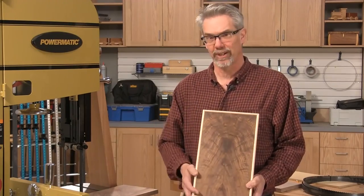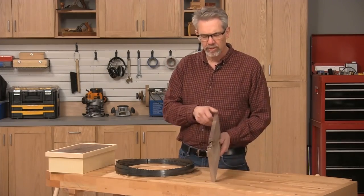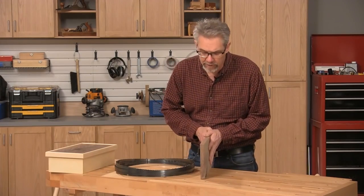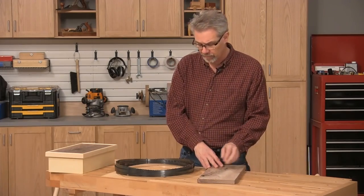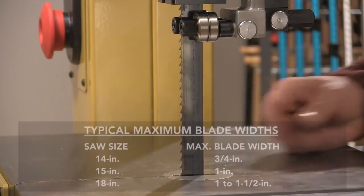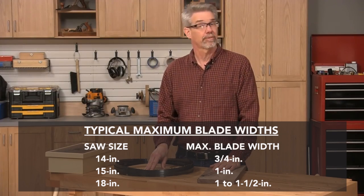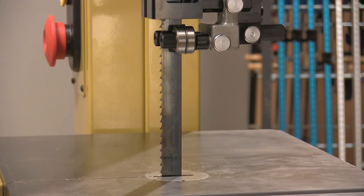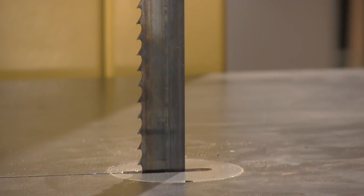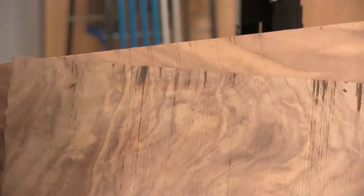How do you re-saw? Re-sawing is pretty easy on a bandsaw, but there are a few rules that will make your life even easier. Your stock should be prepared with two parallel faces and an edge that's 90 degrees to both of them, so you can balance on that edge as you feed it into the bandsaw. With re-sawing, wider is always better for your bandsaw blade. With our 15-inch bandsaw we use a 1-inch wide blade, but most 14-inch bandsaws allow up to a 3/4-inch wide blade, and you can re-saw just fine with that. It's also useful to have fewer teeth per inch on a re-saw blade — here we have three teeth per inch, which is about perfect. It cuts aggressively and clears sawdust effectively. It does leave a rougher cut, but you'll need to surface the re-sawn face anyway, so make your life easier with fewer teeth.